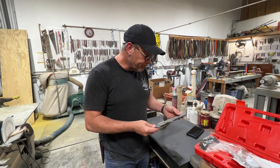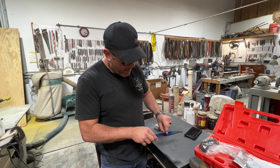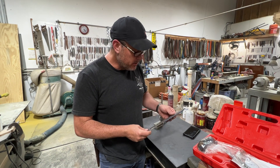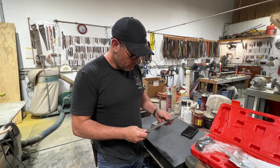That's how we grind. I'll take this knife and grind about half of it while the steel is soft — probably half to three-quarters of the blade — leaving that 40 thousandths, heat treat it, and then grind the remaining steel once it's hardened. That's it.